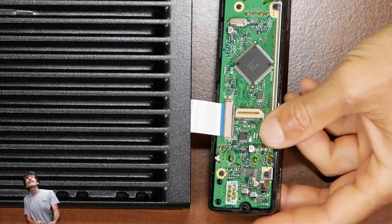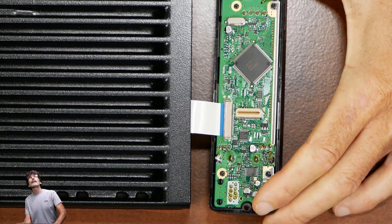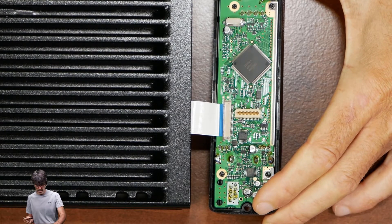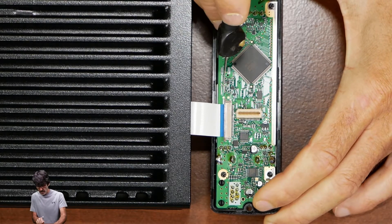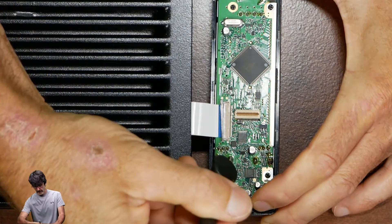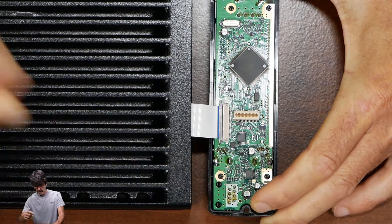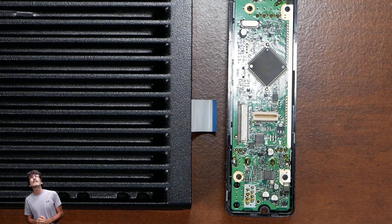So don't just let it drop or pull it out unexpectedly. Turn the radio on its face like so, and you're going to need to get that ribbon cable out of there — it'll just make things a whole lot easier. Just take a small tool and pull these little tabs down right here, and there we have it — that's free and clear.